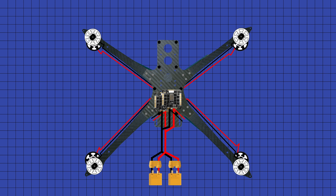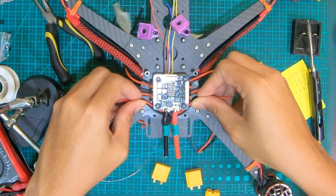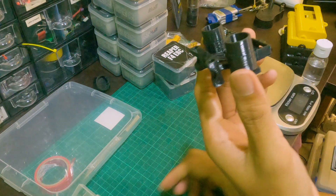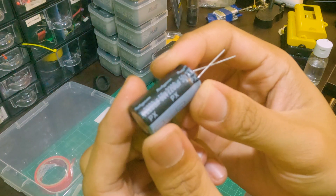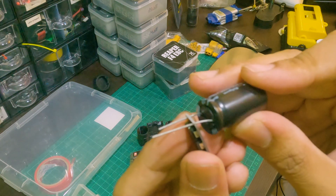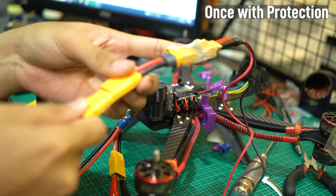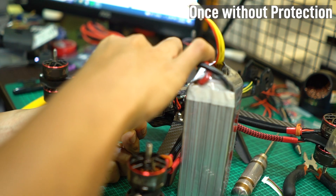Now that the power is sorted, let's go to the low ESR capacitors and spike absorbers. I have a 3D printed part called the Platypus, and it accepts two Rubicon 2200 microfarad 50 volt capacitors. The legs of these capacitors go through the spike absorbers, which are the Rush PDB lite. I went ahead and heat shrunk and wire taped this up. Once I was satisfied with that, I tested it with a 6S rated smoke stopper and it all seems fine.